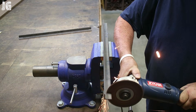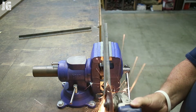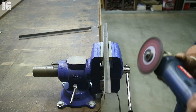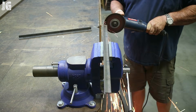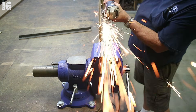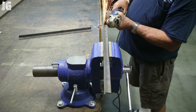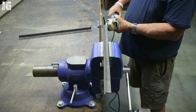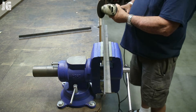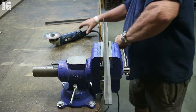I've got everything all cut out and I'm over at the vise starting to mark things out. My new vise from Yost — the 750 DI — is really an incredible vise. It really secures everything nice and firm with very little pressure. So I've marked out the angle iron and I'm ready to cut this out. I'm using what's called a cope cut for my 45-degree angles. This is something I've just started using — it's just a different way to get a 90-degree angle.